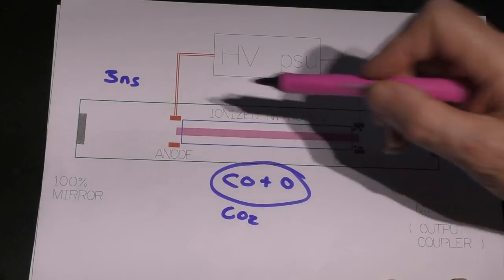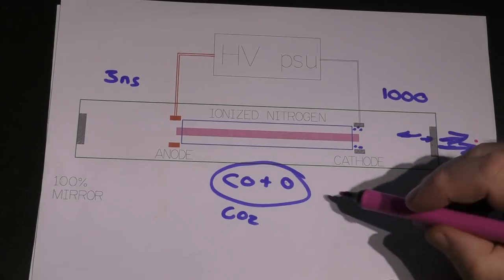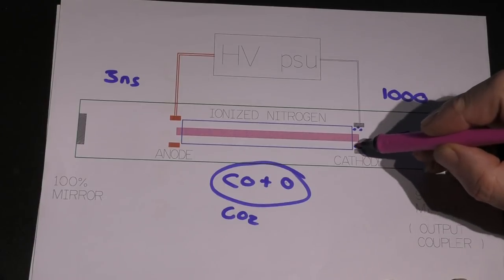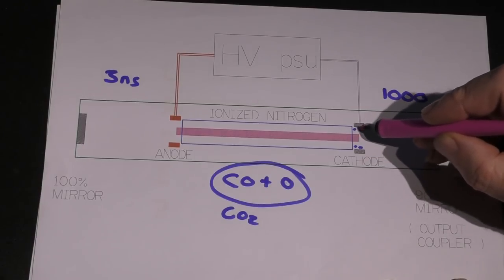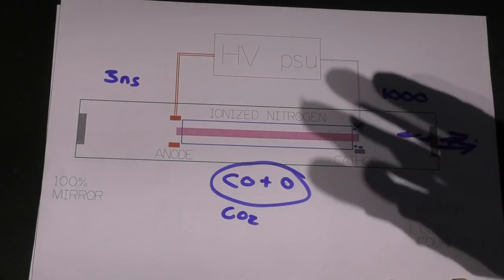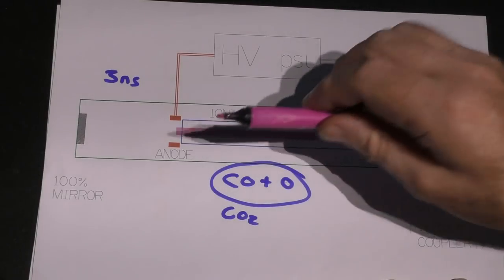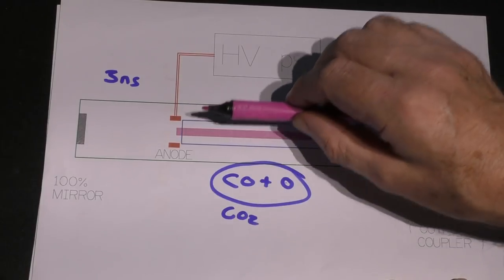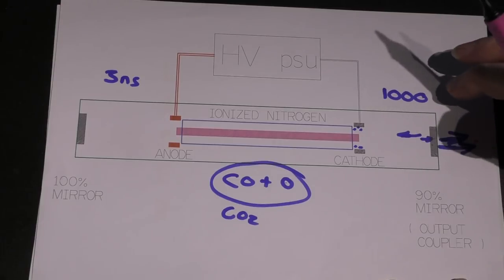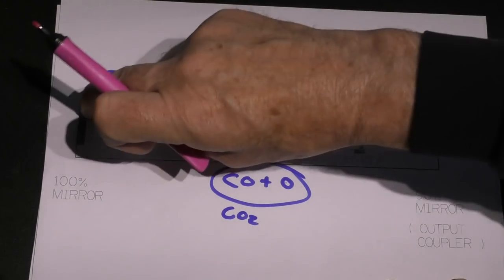You must never overdrive your carbon dioxide gas laser tube. This free oxygen floating around will possibly finish up clagging up the cathode, making it less efficient. There are other mechanisms going on in there which I'm not going to explain, but the net result is that you must be very careful with a gas tube not to overdrive it.